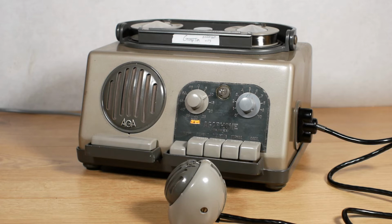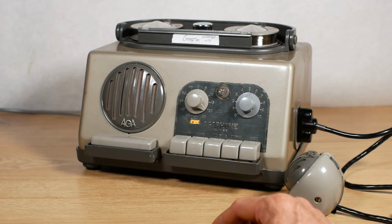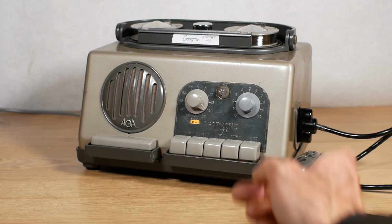When, and not if, the wire breaks, it's quite springy and it tends to partially unwind and get tangled really easily. And as you can see, it records pretty well for a machine that's about 70 years old or something like that. The other thing I could show right now is the repeat button, which is kind of like a review. So if I put it on play and then hold the repeat, it'll just rewind till I release repeat again. So put it on to play.